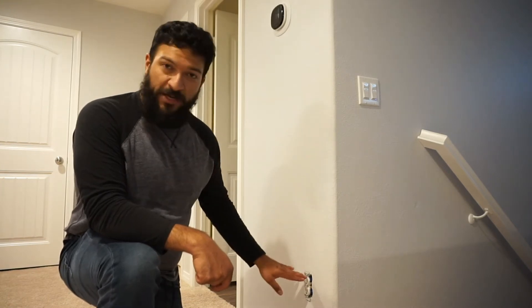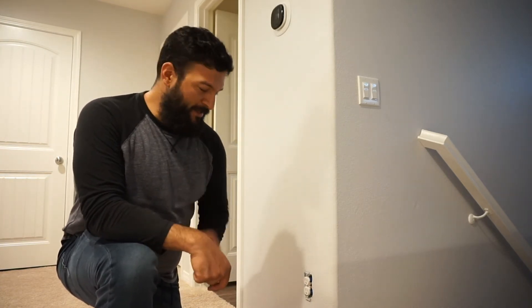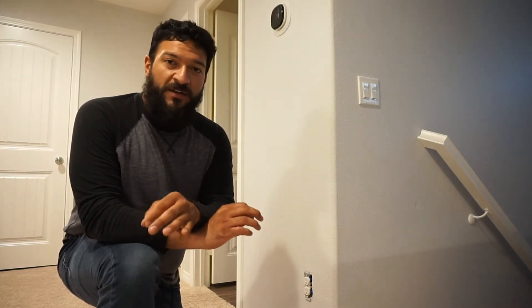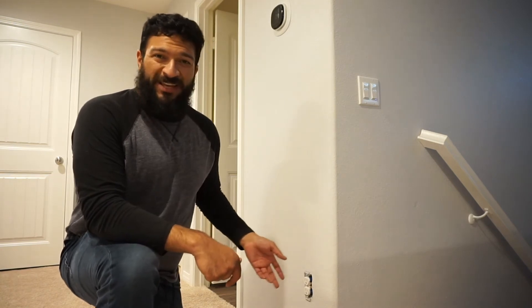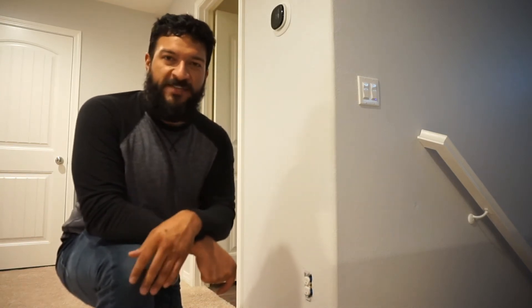If you look at it like that, when we talk about the screws on a plug like this, that makes more sense. I don't need any protection to get my hand right near it, but if I was going to touch it — duh — you need electric shock protection. Whether it's a plug in a house or a flow meter, telemetry devices, anything that's 120V that you're permitted to test energized, technically if you can avoid contact, you don't need electric shock protection. My recommendation: if something could move or you could inadvertently fall into it, wear gloves anyway.